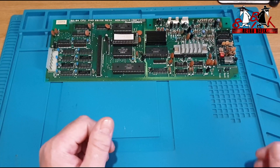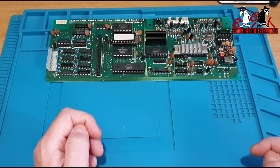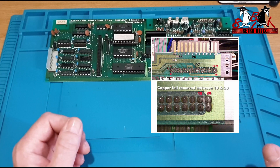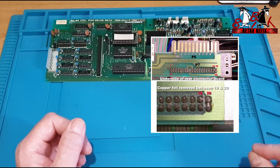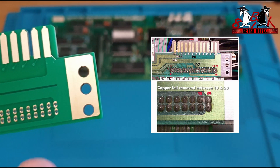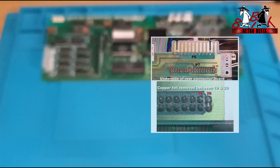I said last week that these were going to be exact replicas and nothing's going to be changed on them. Well, after chatting with Rob, I remembered that there was a user port factory error. On this user port factory error, it has a pin that's grounded straight across, and some of the user port peripherals that go in the back there didn't work, or it shorted the system. You can see there's a little trace cut. So when these boards come out that trace will be removed. Looking at the replica board in comparison to that picture, it looks like they've already removed the trace.